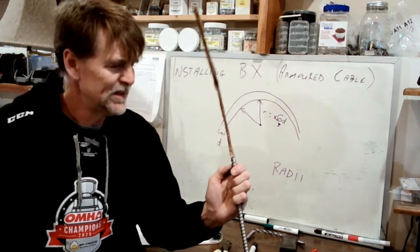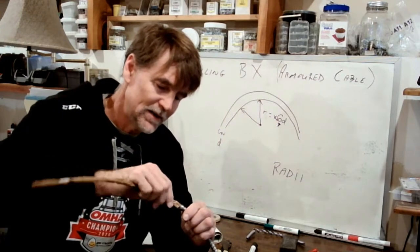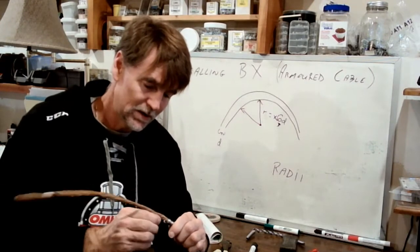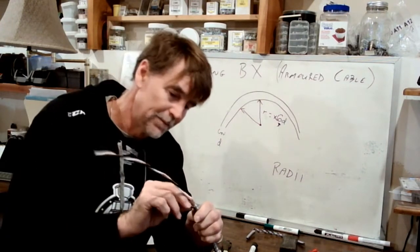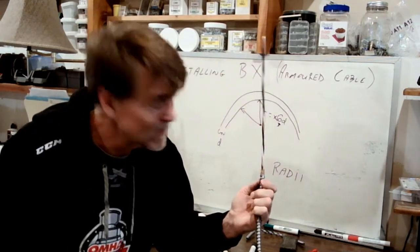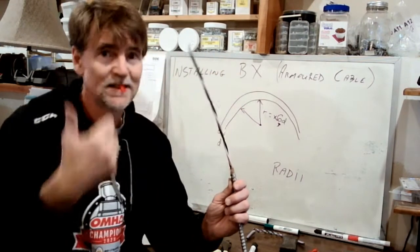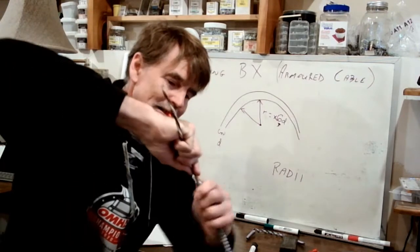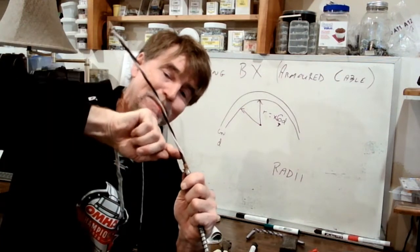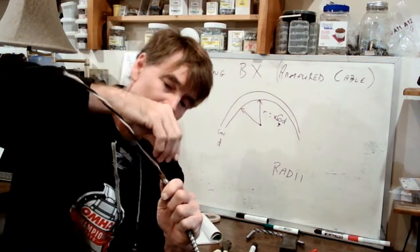But we did potentially cause a little bit of damage to the wire when we did it. Now, we certainly should not have damaged the wire. You can see that while my paper is a little bit scarred, it's still pretty much intact here as well. And I can just pull that off and out of the way. Got a little bit of paper sitting there. Hopefully it's not in our way later. But now, once again, we just have to put an anti-short on here. So I grab my anti-short. That's typically my third hand. And I'm going to twist this down, and you can see the kink in my wire. So clearly we did kink the wire in the process of doing this.